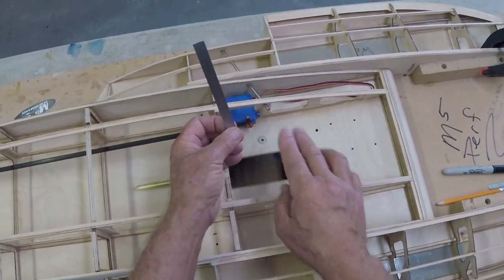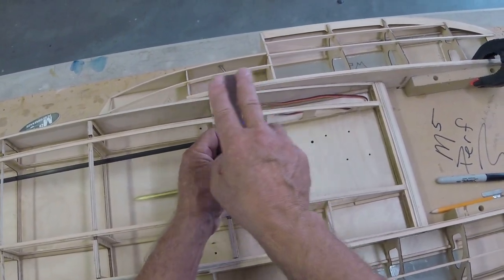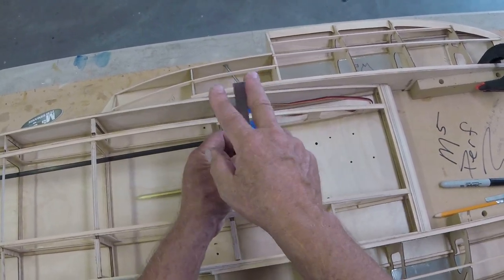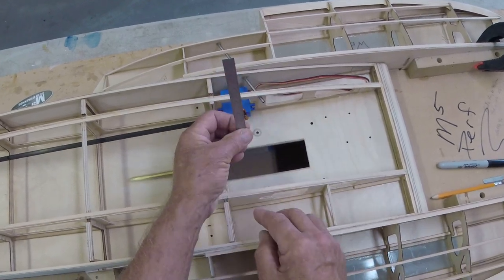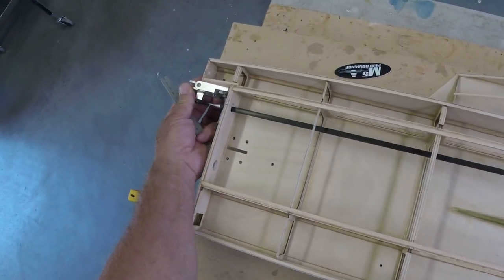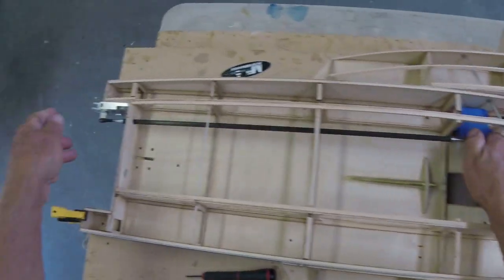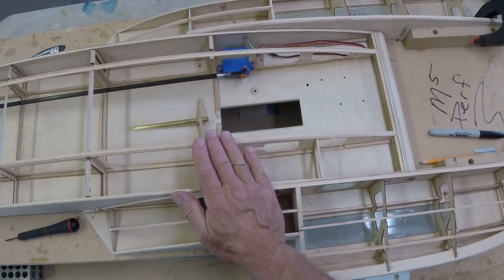So in the point where your steering will most often be, you want, first of all, the most input and the most reliable, where each degree means so much distance, let's say. Okay, does that make sense? So try to target your linkage to where it will land in this neighborhood. For your initial, I'm going straight, you want it slightly overset that way. For I'm turning my brains out, it'll actually be slightly overset this way.